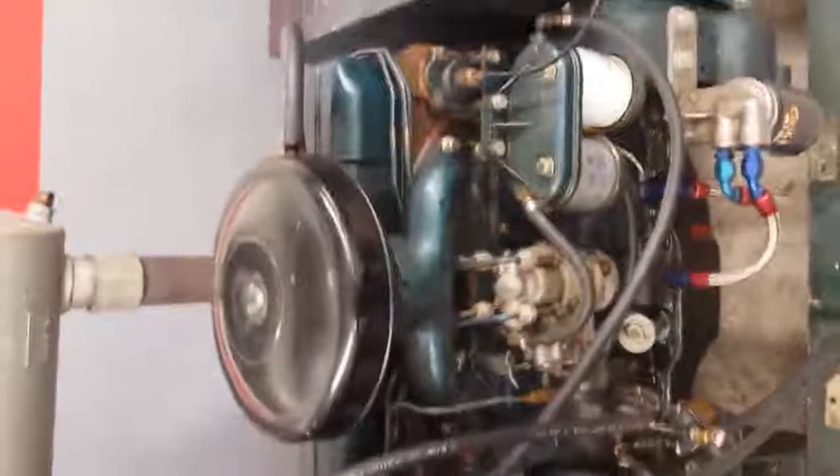The fuel pump is a flex ring pump, so it will need to be run at least probably 20 minutes once a month just to ensure the flex ring doesn't deteriorate, and always keep good fuel in the unit.